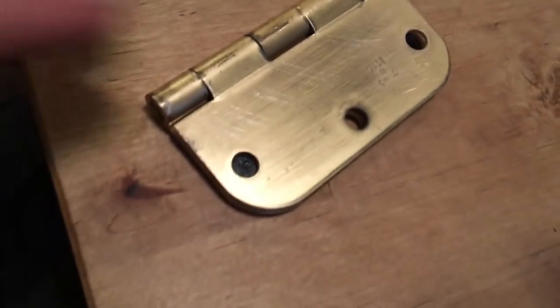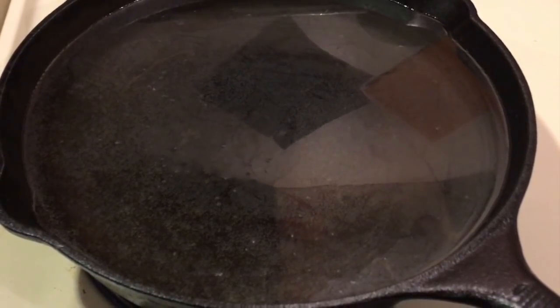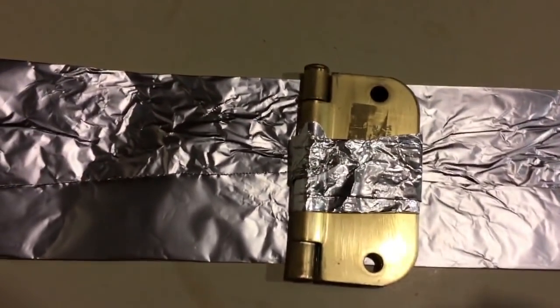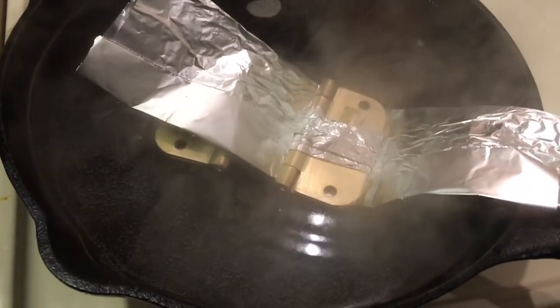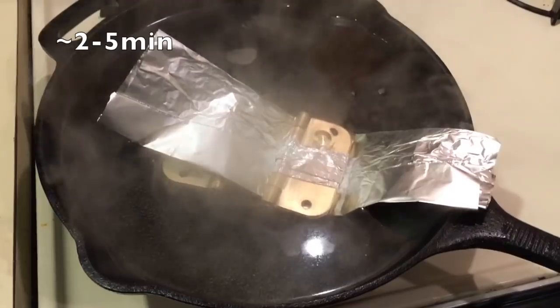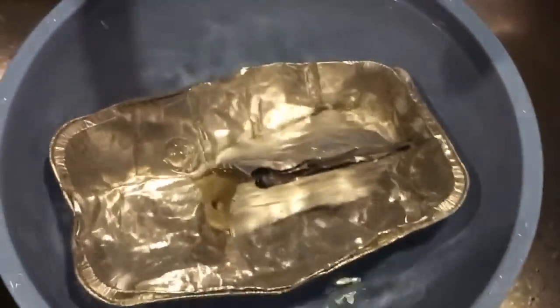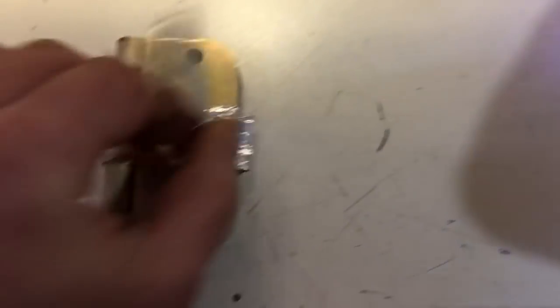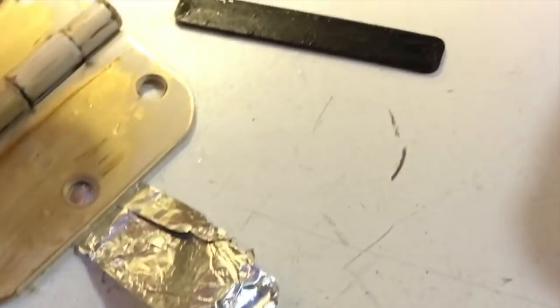But a little while ago, I discovered that I could get the same effect if I just sandwiched the flat parts in between a piece of brass and then just tossed them into some boiling water and let it cool down naturally. But life is short and I'm impatient, so I figured, why don't I split this into two parts and compare them against my standard toaster oven fare and then see which works out best. I split them up, and one I put a convenient little aluminum handle on, let it boil for about two to five minutes, then just poured it out and plunked it into cold water, essentially quenching it like you would tempering steel. As I printed all three parts together from the same filament, it would be an apples to apples comparison.